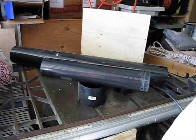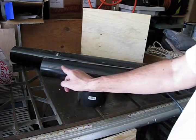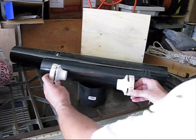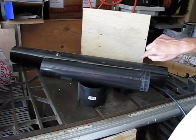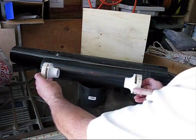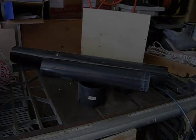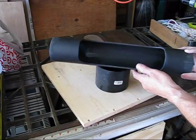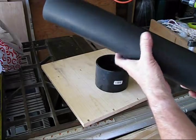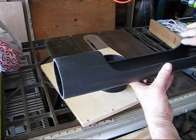One of the main ideas behind this project is to have two bulbs mounted inside this tube facing each other, and then to cut the tube out to let the light escape. I measured and marked a red line, then took my jigsaw and cut down in a circle to cut this section out so the two assemblies will mount inside with the bulbs and the light will come out. Here's the finished tube section — I went ahead and cut it out with round corners, sanded it down, wiped it down with lacquer thinner to take the shine off both inside and out, and sanded the ends so it's ready to be assembled.